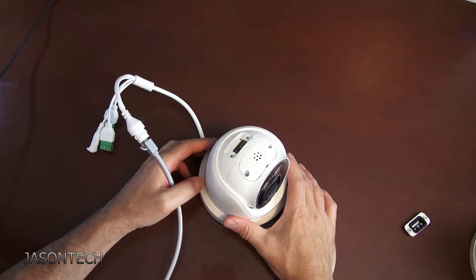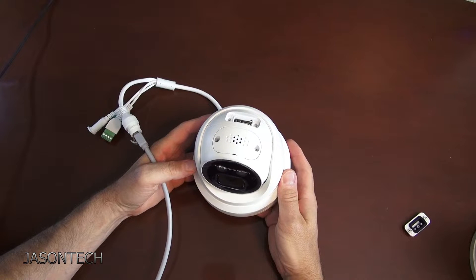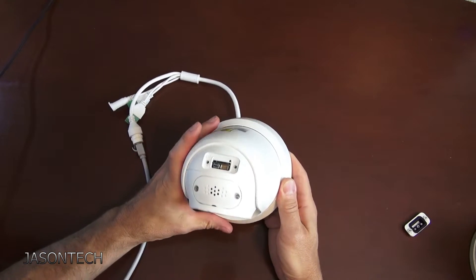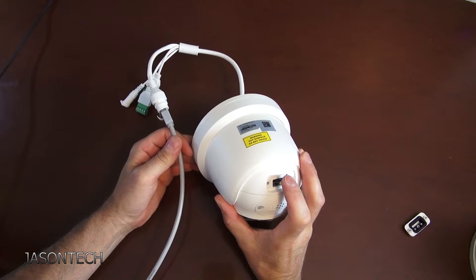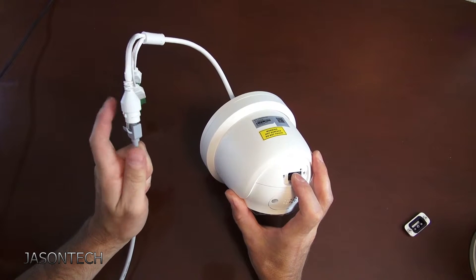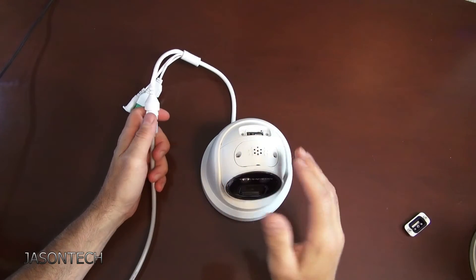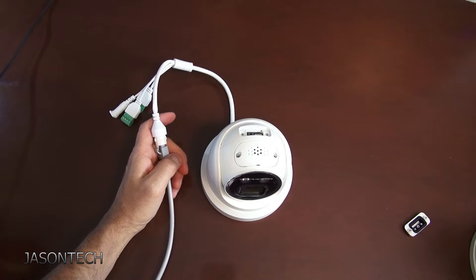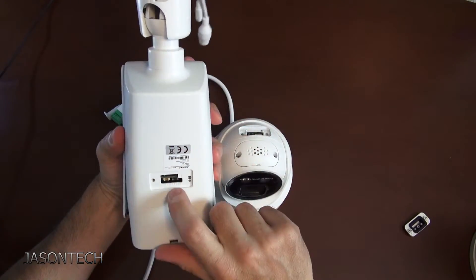Okay, so I'm gonna release it and this camera should now be factory reset. If you guys try to hold the reset button while it's powered up it will not factory reset. You do need to hold the reset button down with no power connected to it — pretty much every IP camera is like that. Here is a bullet style camera — same thing, there's the reset button.